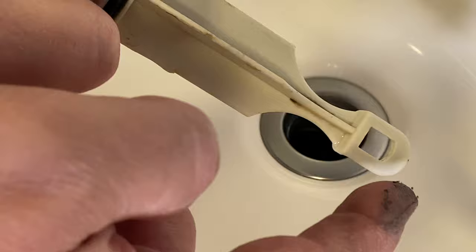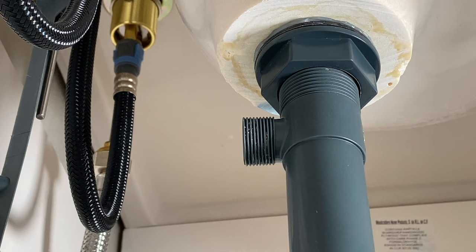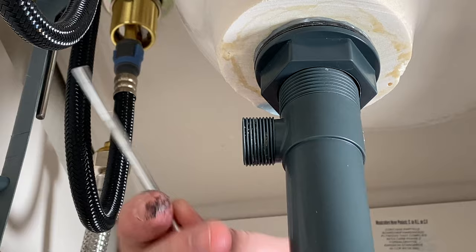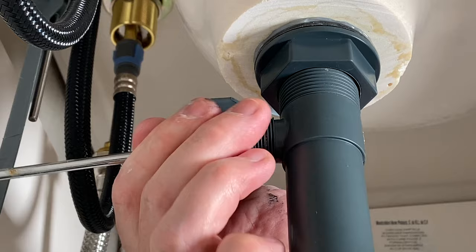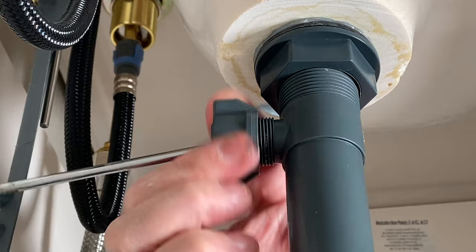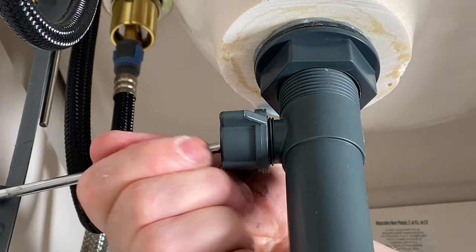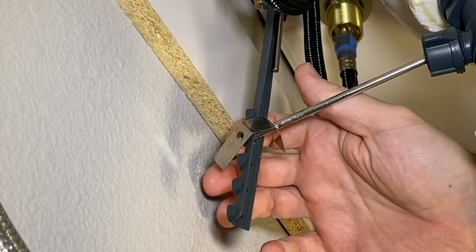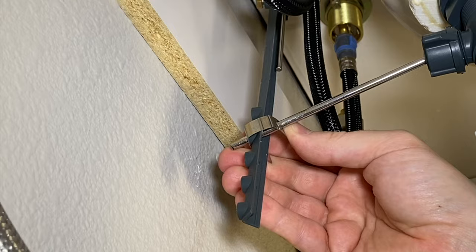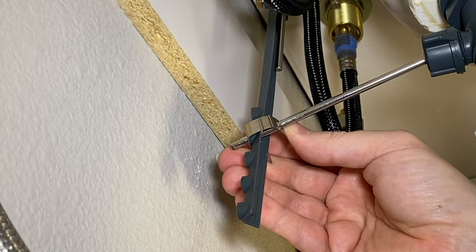So now you've got that put back together. We've got the stopper here — you're going to take the stopper, put this side in the back, and just set it straight down in there. Now that we have that stopper in place, we want to put this rod back in place. Grab the rod — because that was already down, it's kind of already in place — so then we just tighten that down. And the pop-up is ready to go. To put this clip in, you just take it and put it in one side; there's two holes. Find the matching hole on this long piece right here, and then just clip it together and put the back side in. And we're good to roll — that ain't going anywhere.